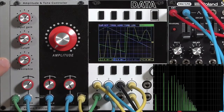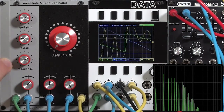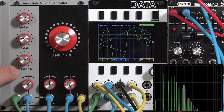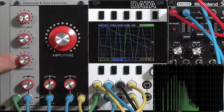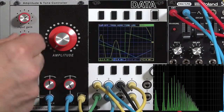It's almost like an oscillator FM pair. And because this filter does self-resonate and go into oscillation, you are in essence frequency modulating a sine wave oscillator, just on the edge of producing its own tone. Actually, it is producing its own tone — my resonance is that high. Let's bring in the input and tune these.